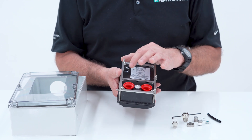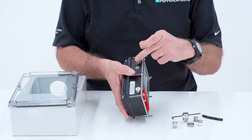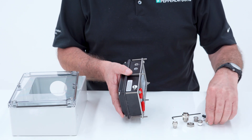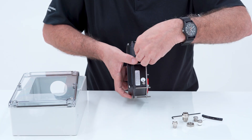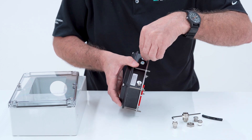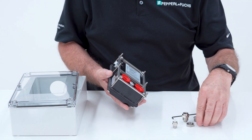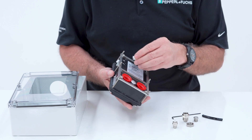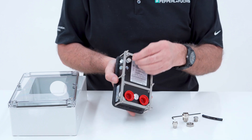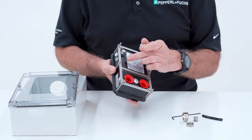For my conditions I'm going to reference the back port, so I need to block up both the high and the low port on the side. These fittings come with the control unit. I would plug the low pressure and then plug the high pressure, making sure those are tight. Then I would put a sintered element on the high pressure point because this is inside your enclosure — it's referencing the enclosure pressure, and the sintered element keeps out dust and dirt.